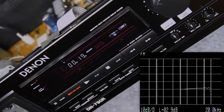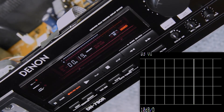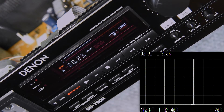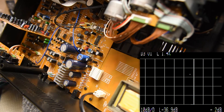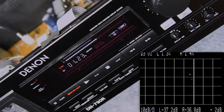I'm fast forwarding through all this, just showing my process. Everybody has their own way — this is mine. Here's my distortion test. Now that I've got it dialed where I think it's good, I'm running the distortion. I'm seeing the distortion way out of line on that left channel — 2.3%, at around 0 dB or minus 1 to 2 dB — and that's too much. So I'll balance these out. You can see on the right channel it's much better than that, and what I've done here is I've balanced it out.